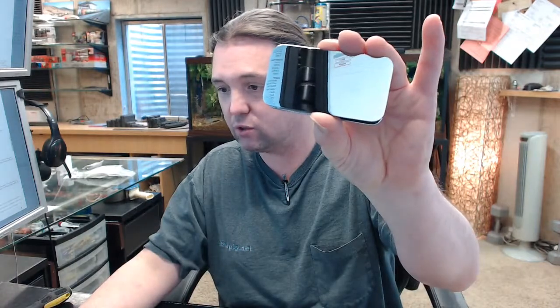There is a link below this video to a document called the cut sheet, which is handy because it shows how the glass preparation needs to be done to get two pieces of glass to join very tight. You are going to drill a 5/8 or 3/4-inch hole — essentially half of that on both pieces of the glass. Review that cut sheet for your manufacturing.